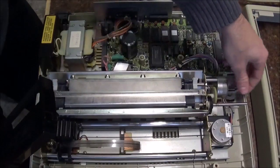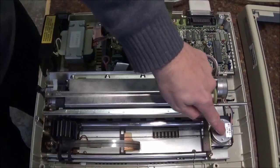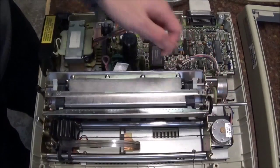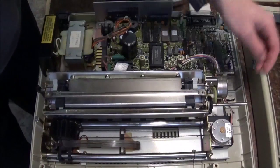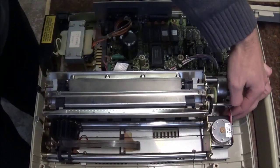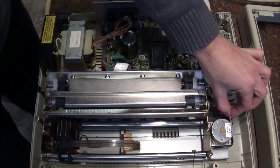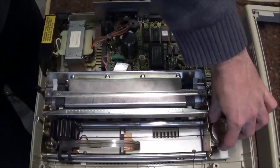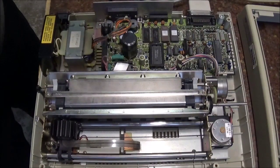This step motor here advances the line. The step motors themselves are SME040s — as you can see written on the top there — which are actually made by Epson for this printer. Interestingly, they're unipolar, so you can see there's six wires exiting them in two sets of three, which means there are probably two rotors stacked on top of each other. They advance 7.5 degrees per tick, which I think is pretty interesting, because I've never actually played with a step motor that hasn't been 1.8 degrees.